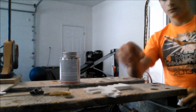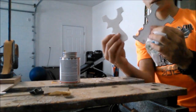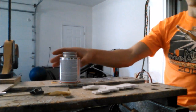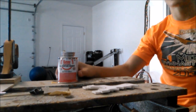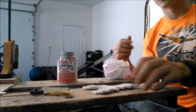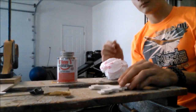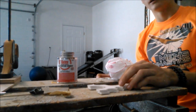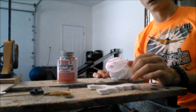Now we're going to glue the two pieces we just cut together. I got this all-purpose cement for PVC, and what we're going to do is sand the inside parts a little bit, brush on the cement, and then clamp it and leave it for a couple hours.